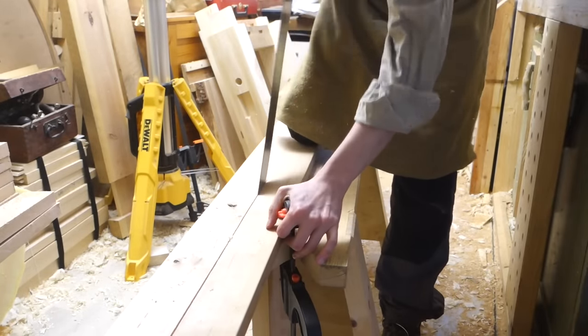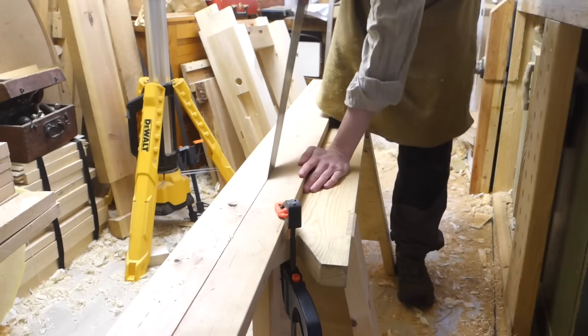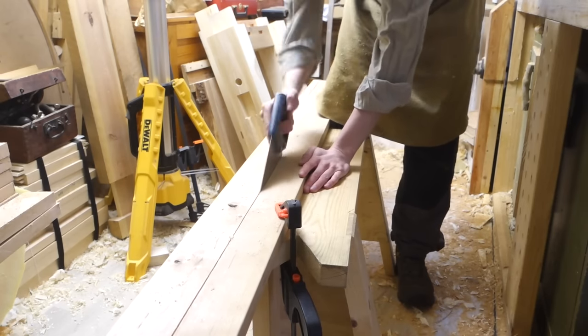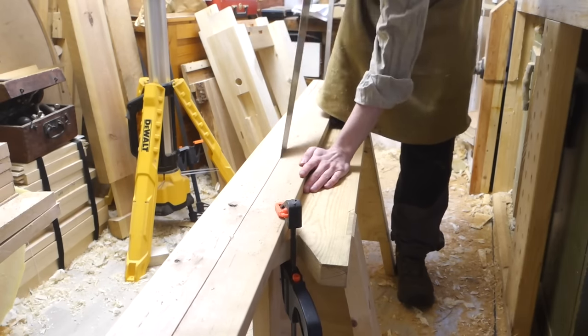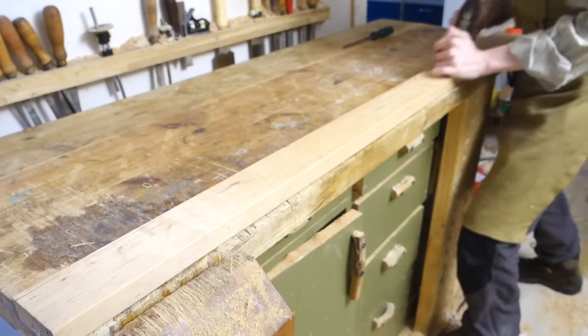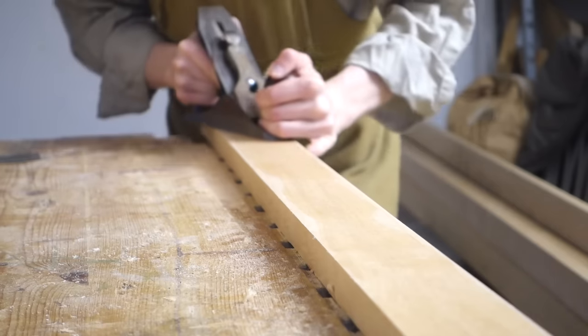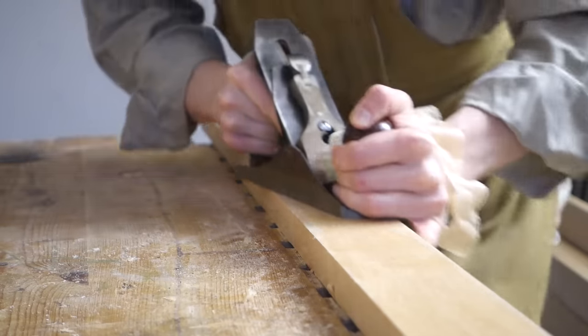This is a soft maple and I ripped these flat sawn boards into approximately 2.5 inch wide strips to stand on edge and effectively give a quarter sawn slab when laminated. I didn't really flatten these, figuring they are long enough to simply bend into flat when pressed together, so I just smoothed them to prep for glue.